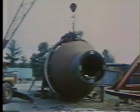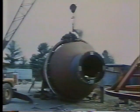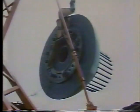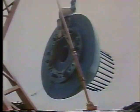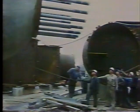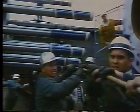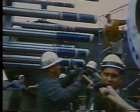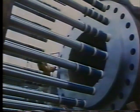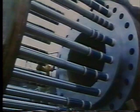The shaft is now ready to receive the sphere. For the first time, the two will be joined together. The 28 studs which hold it to the shaft were first threaded into the sphere. Coated with asphalt paint and covered with fiberglass and resin to protect its machined surface, the sphere engaged the 10-foot diameter spigot of the shaft. A risky business.